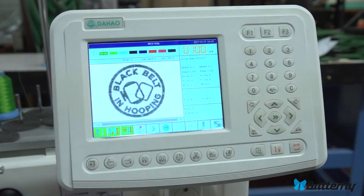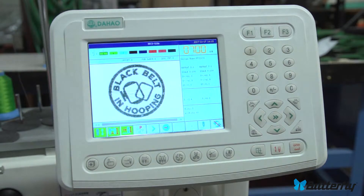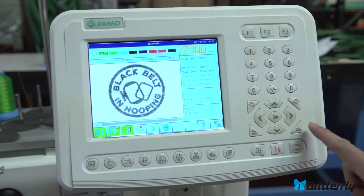Return the shaft to 100 degrees. Most embroidery machines need to have the shaft at a home position or 100 degrees before it can do anything, especially color change. So when the machine is at rest, that shaft is usually at 100 degrees. If after travel or after some event it's not exactly at 100 degrees, the machine will complain.